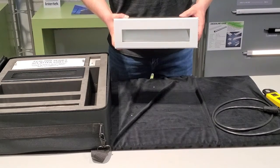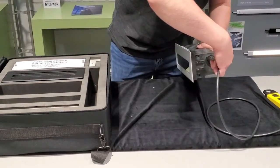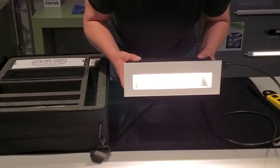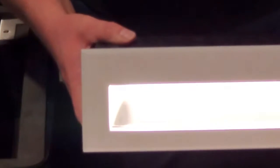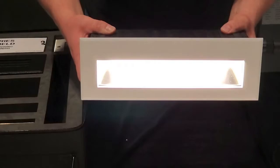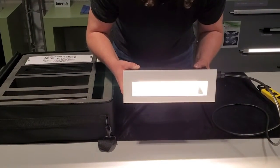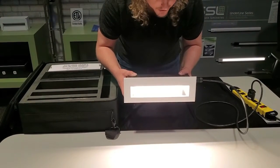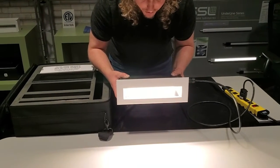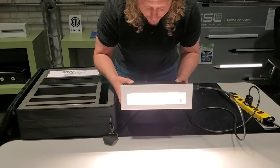It's still above 100 lumens per watt. This reflector is an anodized reflector — a high specular reflector with diffusion that really adds to the performance of the LEDs. There are about 33 LEDs in here, giving nice efficiency and a good throw both forward and at wide angle. Center-to-center beam spacing would be the optimal footage — we can do photometric studies.